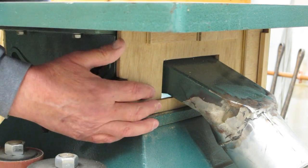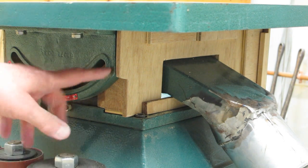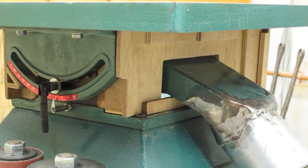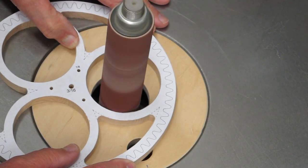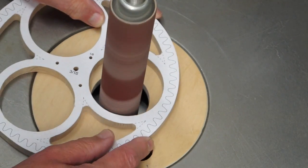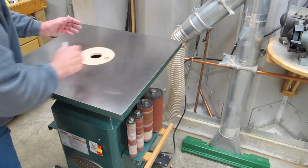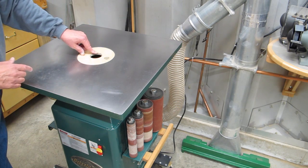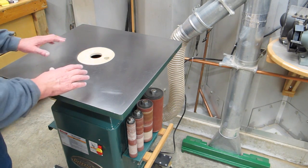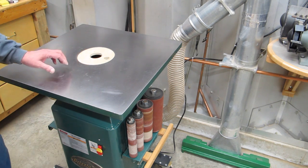It also keeps this one from falling over. And that's it — it is then pretty well surrounded on all four sides. You still have slots open in through here and that, but this has proven to be effective enough where it creates a decent downdraft around the sanding sleeve. The idea is simple: build a box around your work area and force the air to go where you need it for effective dust collection. This is another good example that you can create effective dust collection for just about any piece of equipment you have.